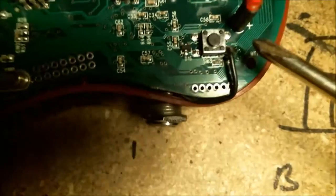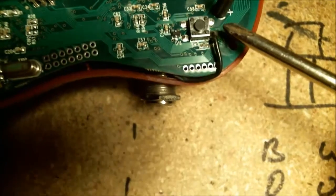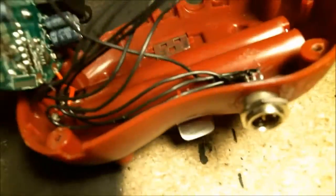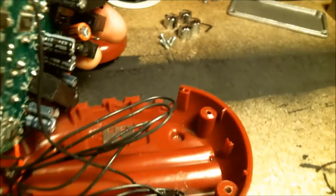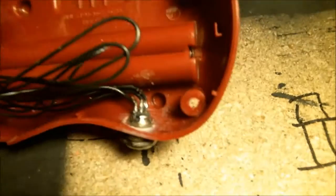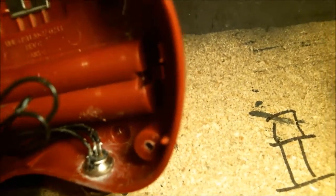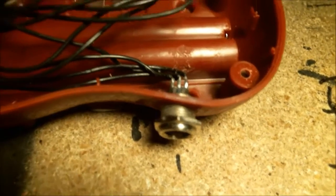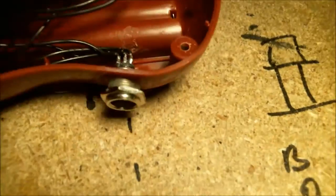And then you also hook up a wire to the bottom right corner of this switch here for the tap tuner. So that's done. And you hook the wires around the side. Kind of be careful not to get in the way of anything. And then I used a 4-pin mini XLR plug. Drilled a hole in the housing, and first I installed it with a nut, but then it would be in the way of the board too much and it wouldn't quite fit, so I just pulled it out a bit and glued it in place for now.